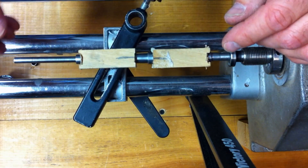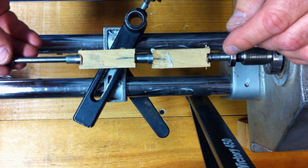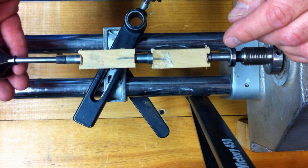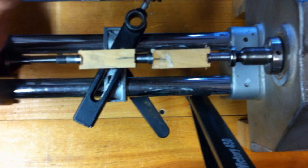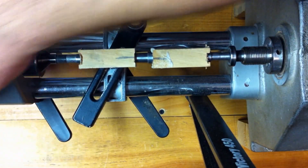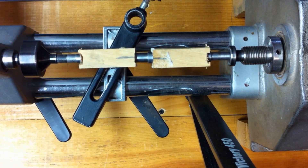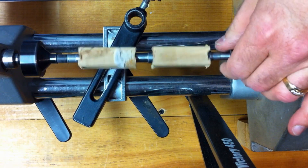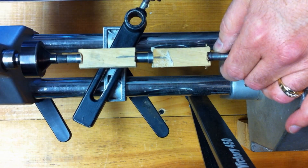It's kind of tight right there and I don't want to be right up on my mandrel saver, so I'm going to drop a couple of bushings on the end and put my mandrel saver on. I'll drop that into the tailstock, bring my tailstock up, lock it, and tighten it down just a fraction. And now we're basically ready to turn the spalted pecan blank.